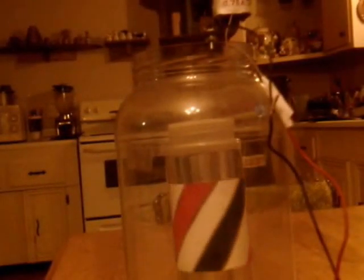Something I didn't say too: there is no shaded pole on the coil in there, the inductor. The coil's on one side, and the core of the inductor is oblong. It goes around kind of like a G shape to the other side, and somehow that gave it the spin, and that's what's kind of odd on that for me. I hadn't seen that before in anything.